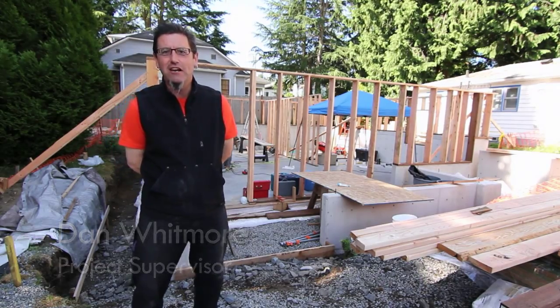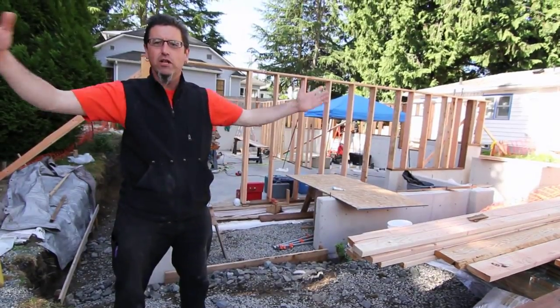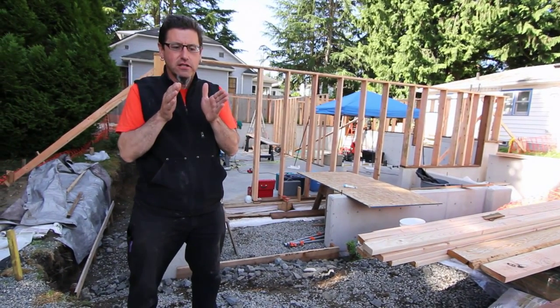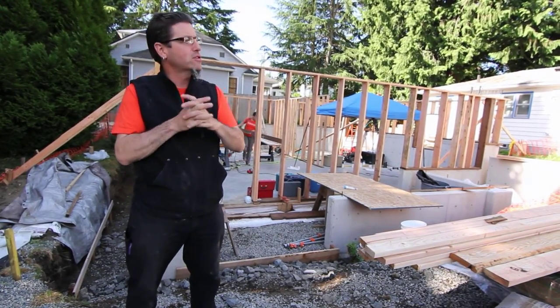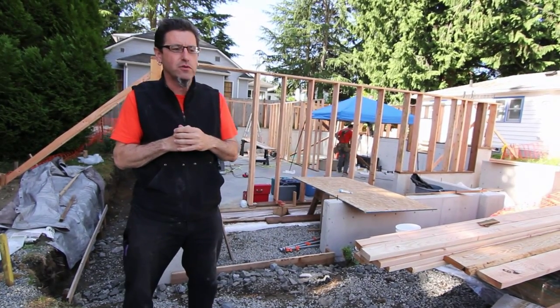You might notice it's pretty shady here, so we're building a passive house in the shade. We're not going with our annual heating demand; we're going with the heat load on the coldest day of the year. Partially because we're so shady here, we can't really utilize this whole exposure.